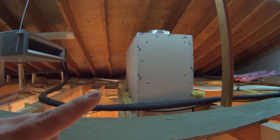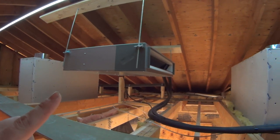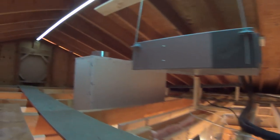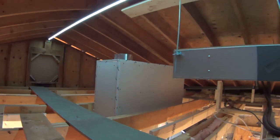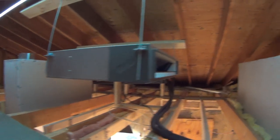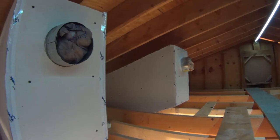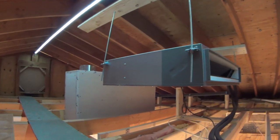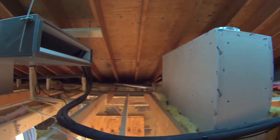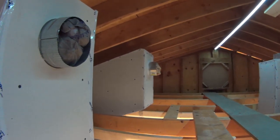Up in the attic — one of the 8-inch boxes is in for the control room, and that is the heat exchanger making the hot and cold air: 18,000 BTUs. The other 8-inch baffle box for the control room is right next to it, both very close to the heat exchanger so the duct runs will be nice and short. Turning around, these are the other two — the 6-inch slanted ones for the live room / vocal booth. All four are nicely clumped together, which was by design and also the only way to make them fit up in this space.